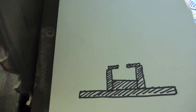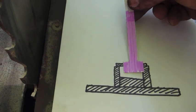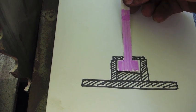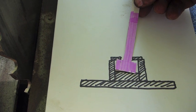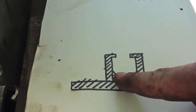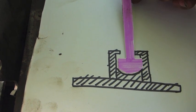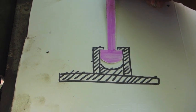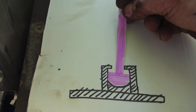When I was first using this saw everything seemed really, really tight. I'd take it off, oil it, and it seemed fine, but put it back on and next time it seemed really tight again. The cross-section of the little footpad on the drawbar — it's just a piece of one-inch bar with some washers welded on the end. Fine when everything was level and square, but on an uneven surface it would quickly jam and no amount of oil was going to fix that. I took it all apart, made a dished brass bush to go in the bottom, domed the end of the spindle to suit, and widened the dimension so it wasn't so tight. It's still tight enough that it won't drop out, and it gives a little more angle wiggle factor — it's a dream now, works great.